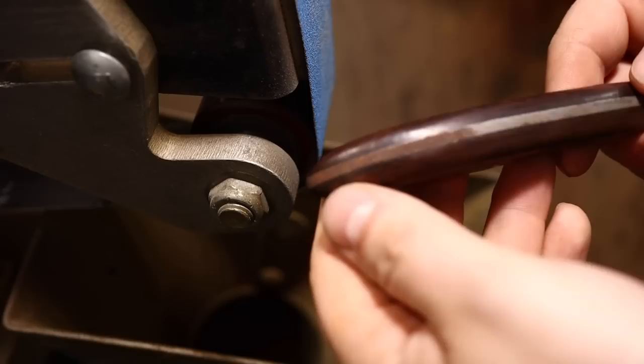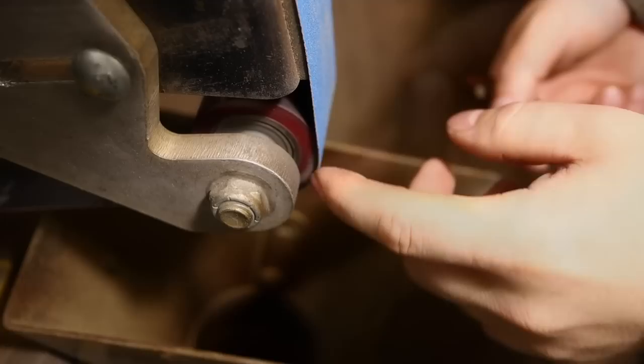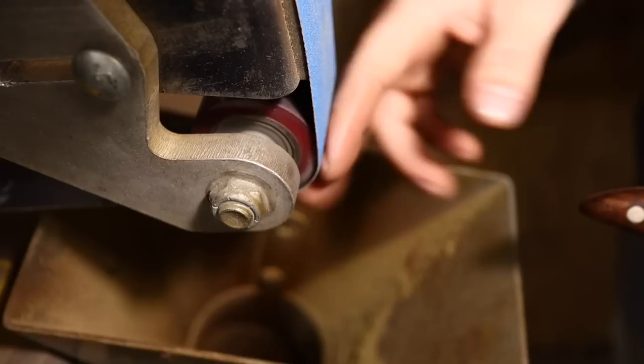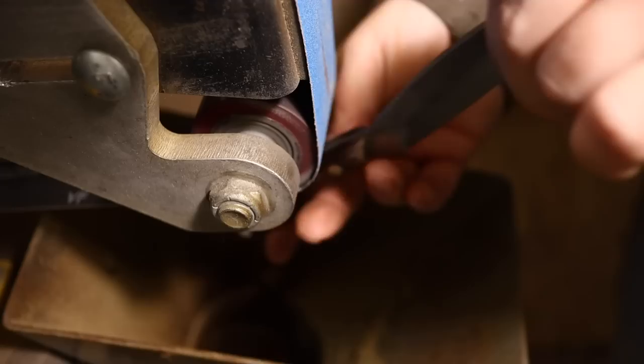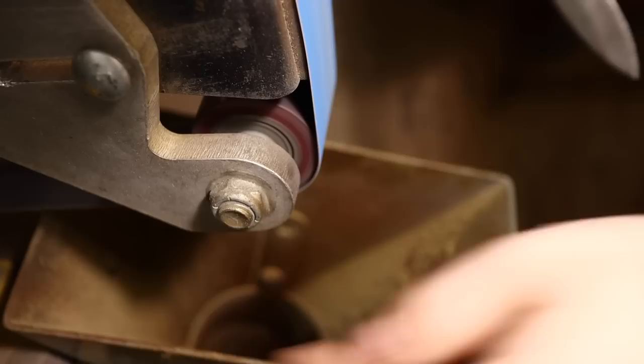Now I'm going to take it over to my belt grinder and concentrate on this tang here. Look at that heavy rusting, and some pitting along here as well. You'll notice the red on this wheel — this is a contact wheel and it's a silicone wheel, like a soft rubber that doesn't have the harshness when a belt runs over it. That is my preferred way. I'll take this tang in, strip right up tight to that jimping, and go right up to this point on the inside. We'll end up with a beautifully finished tang.